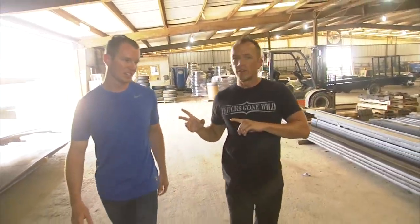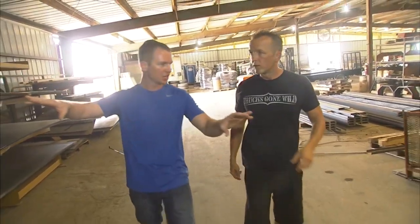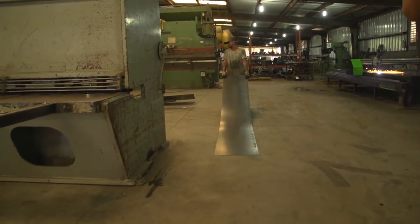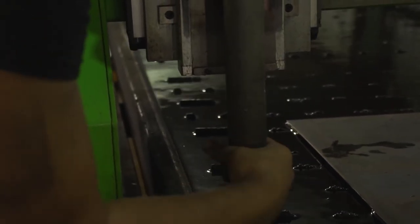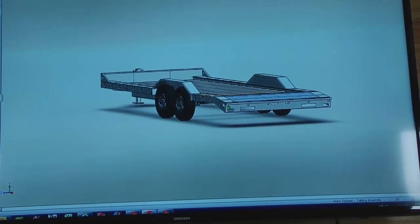It's a lot cooler in here. There's metal everywhere. So what we do from out there to in here, it's going to come to one or two sides. We've got structural on this side, we've got sheets on this side. These are CNC plasma cutters — two 20-footers, 40 foot of cut capacity. We do this all in 3D CAD, flatten it out, and cut it right here. You pick your flavor of metal, throw it up there, and it cuts it out. All this guy does is hit start, set his feet up there, and take the parts off.